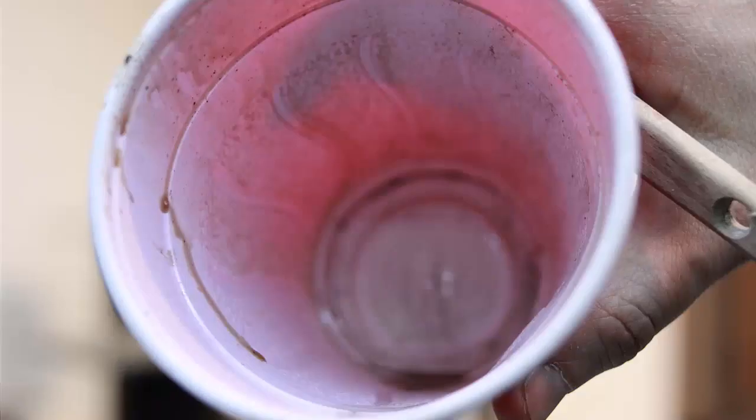One other thing I wanted to point out was it's best to do it in small batches, because when you're wiping on this rusty metal, it gets into the liquid in whatever you're mixing in. So by the end, it's a bunch of dirt and rust in here. So you probably don't want to mix a big batch. Just do small batches and then dump this rust out.